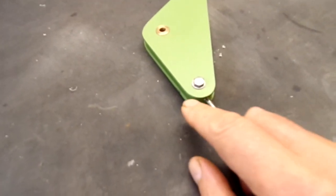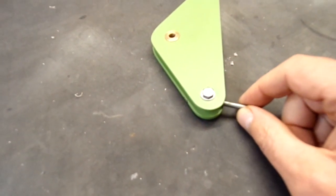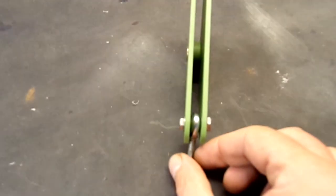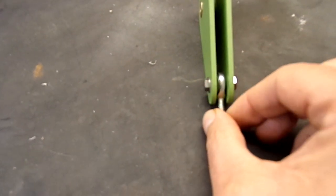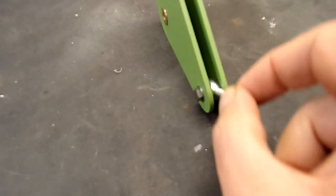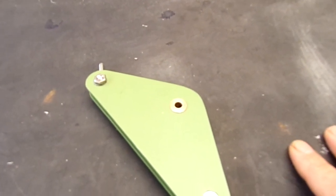On the actual plans, the operation for the bell crank is with tubes going directly in here with bolts acting as a pivot on the tube, and that can rock slightly because of the angles at which it's set. So I've gone for these rose joints at the ends, and the control rods will go directly onto here. I'll make threaded inserts to go inside the control rods, and that way there's no play, no chance of this moving in any format. It can articulate sideways as well as rotate. They're sealed bearings so there should be no wear, and in here no lubrication will be needed because of the phosphor bronze, so no chance of dust or dirt going in to create wear.